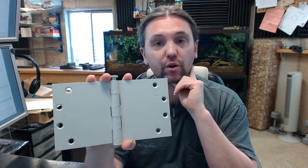Another reason that you're going to use this is, imagine a very thick wall and your door is actually set in deeper into the frame than standard. When you stand on the pull side of a door and frame and you run your hand over it, that door is inset ever so slightly into the frame, 3/32 of an inch, generally something very small like that. Well, imagine if that dimension was 1 inch. It's certainly very possible.